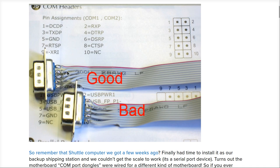But the top one here, labeled good, is so labeled because if you pull apart the wires in the ribbon cable, as you see in this picture, you can clearly see that the wire with the stripe on it is usually pin one over here. If it's not, go find another manufacturer, okay? But the one that's so marked is pin one. And if you count the wires in the ribbon,